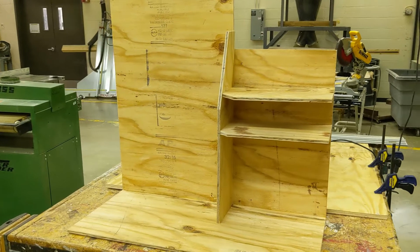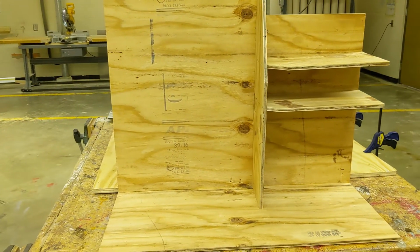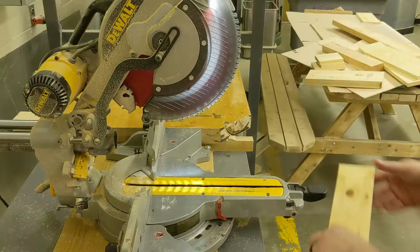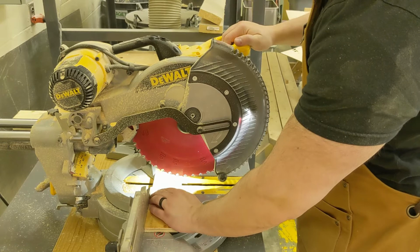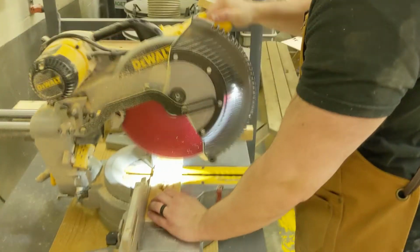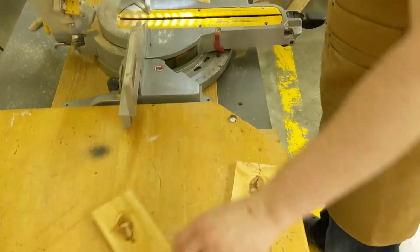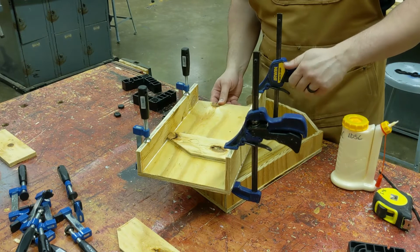The first obvious critique is that the shelves aren't supported all around. One of the things I try to impress upon my construction students when it comes to designing with fasteners is the application of forces. How much force will be applied on these shelves and where? If the centroid is within the triangle of support and the force is minimal, in this case less than 3 pounds each, then the shelves will be fully supportive.